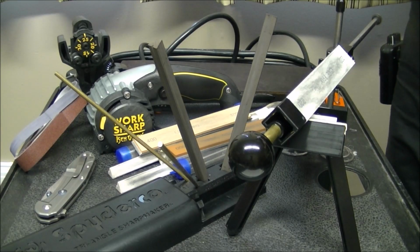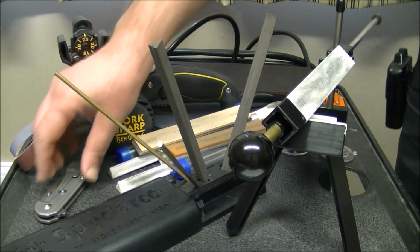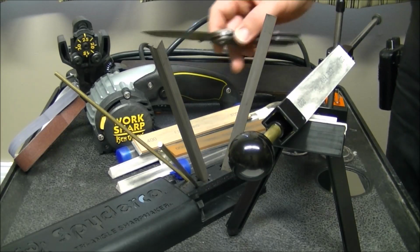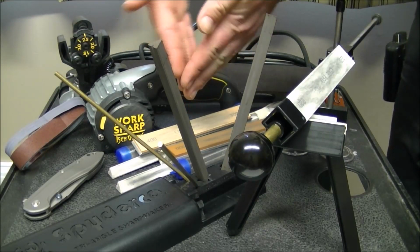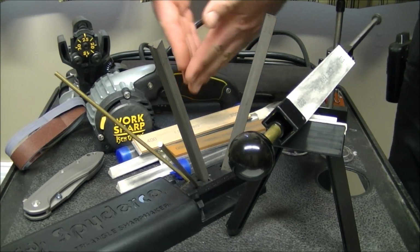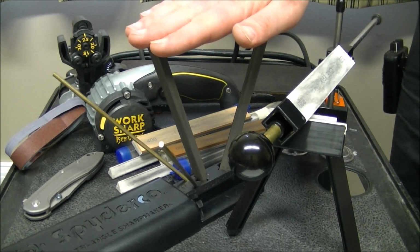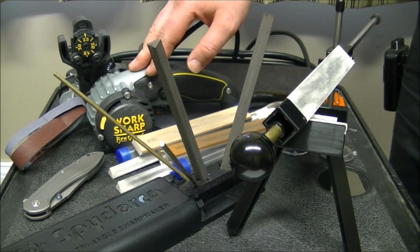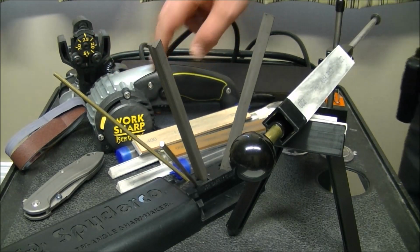Okay, so take some time, and here's the things that, by the way, this ties into another point, but what you want to do is when you're going to sharpen your knife, I think everyone understands that on this knife there's an angle that exists, right? So the secondary bevel is coming down to a point, right? Well, you need to know what angle is it that I need to be working on? Something like this is set at 40 degrees inclusive. Something like this is adjustable. This is also adjustable from I don't know, 15 to 30 degrees.